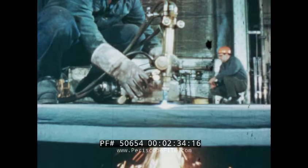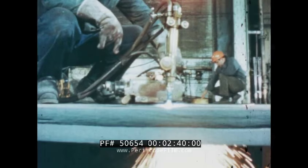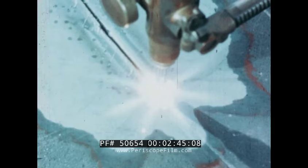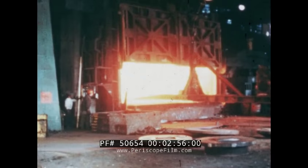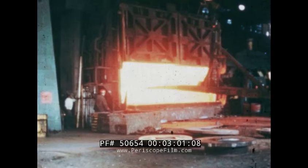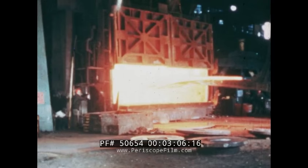In order to construct the pressure hull, which has a finished wall thickness of 1 1/3 inches, a special high-strength steel sheet is cut in a circular blank. From this, steel hemispheres will be spun. After the steel blanks are heated in a furnace to the proper working temperature, they are moved to the spinning machine, which rolls the flat sheet into a hemisphere in a series of operations.